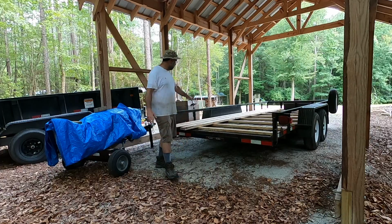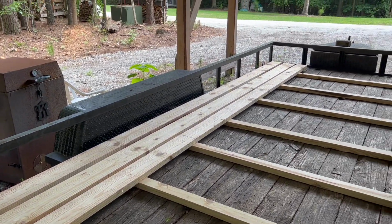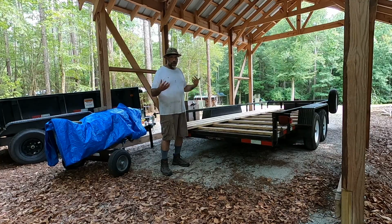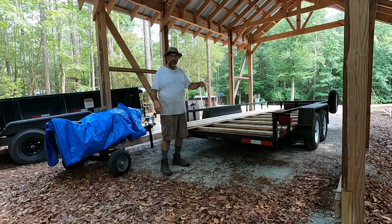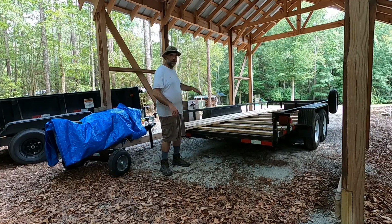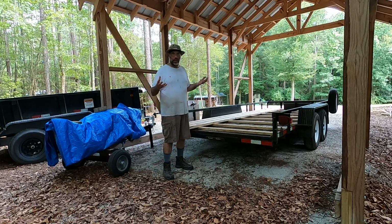And I've got some boards here right now. These are really volunteers. I wasn't counting on cutting any keeper lumber today, but I got 3 extra 2x6s when I was sawing these bunk pieces, and so those are stacked over here. And what I'll do is I start moving through my log piles. I'll keep layering the lumber here in a reverse order of how I plan to use it for construction. Put stickers down between every row basically,